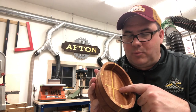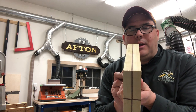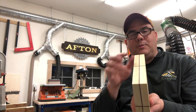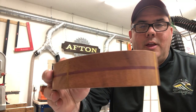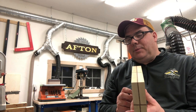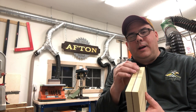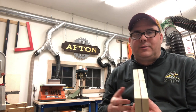So how did I make this? How did I get these pieces of wood going all the way through? Let me show you a prototype I built this weekend. This is just poplar and masonite — you can see it's two three-quarter inch boards, very standard, I had it laying around. The first step is to think about it like a sandwich: you've got two pieces of bread and you put something in between. In this case it's masonite, and in the finished product that was the purple heart. You glue that up, let it sit overnight. I use Titebond 3.